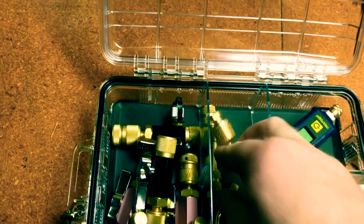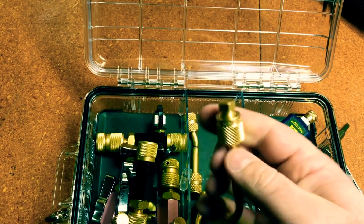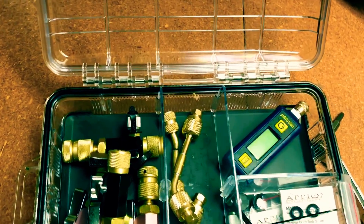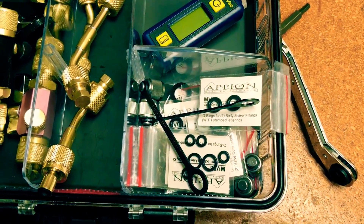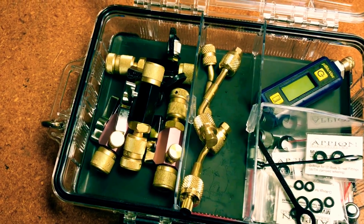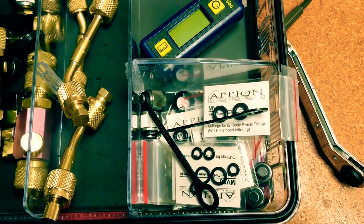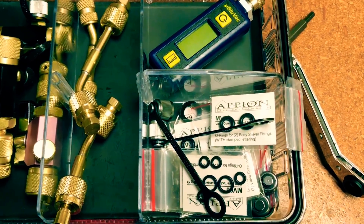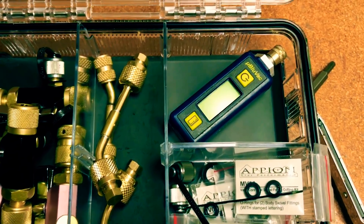Yellow Jacket did just come out with their version of the micron gauge coupling, and it looks very solid and well-made. I keep it plugged, and like all Yellow Jacket hoses you can replace the depressors and the gaskets as needed if you suspect a leak. I keep several Appion rebuild kits in here because these are vacuum rated but they absolutely do leak — I've had them leak out of the box and over time. These kits are a necessity, and when you do rebuild them they perform as advertised. Make sure you're keeping extra parts or it'll let you down and you'll pull your hair out wondering why you can't pull a vacuum.